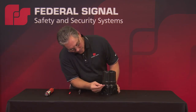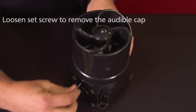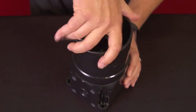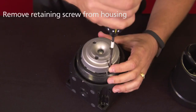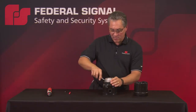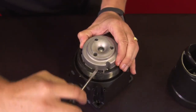The first step is to loosen the retaining set screw that holds the audible cap in place, then simply unscrew the audible cap. There's a retaining screw that holds the whole assembly into the housing — simply back that off. Now this is a press fit into the housing, so if necessary you can pry gently with a screwdriver into the slots.